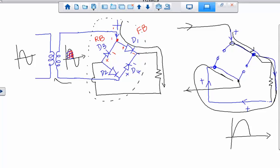How many diodes are conducting at any given time? Yes, 2. So take a look at your formula for V peak out. It says minus 1.4 because 0.7 for each diode and the signal passes through 2 diodes. So you have to take away 1.4 from whatever signal is coming in. In this case, the signal coming in from the secondary side of the transformer. So whatever that secondary peak value is, you take away 1.4. So are we clear? This is only for which cycle?